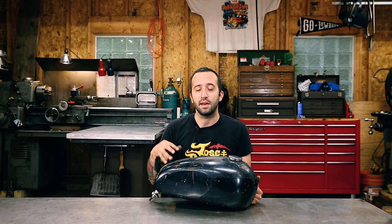The first thing that you're going to want to do if it's a used tank like the one we have is to purge it and get all the gas out of it to make it safe to work on. So let's go outside and I'm going to show you how to use your car to purge your gas tank.